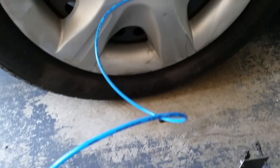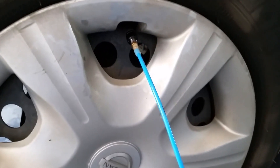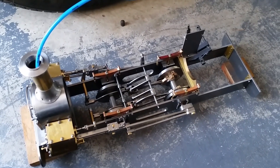There has been power threading brass with a split die. Nuts have been made for various parts in brass and steel. A piston rod thread has been extended without removing the piston, and an oil hole for the crosshead gudgeon pin has been added.